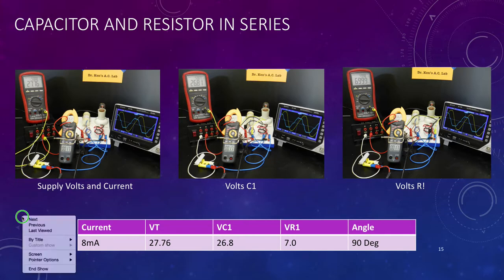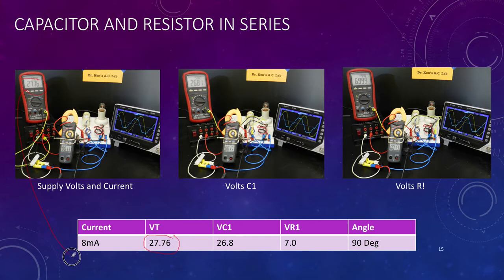So let's look at our three readings. The first one, we've just got the supply reading the voltage, so we've got 27.76. That's where that comes from. I've got to divide by 2 on here, so we've got about 8 milliamps flowing on my multimeter. I can tell that because I put 2 loops of wire, so I have to halve the display, giving me 8 milliamps. And we can see that the voltage across the capacitor is now 26, so that's our reading in here. So we've got 26.81